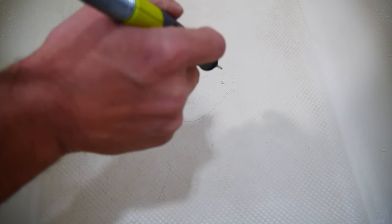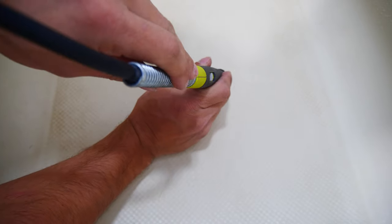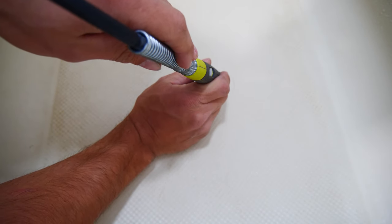Before we begin fixing the area, we want to stop the crack from being able to spread further. We will do this by drilling out both ends of the crack, which removes the strain on the area and mitigates the crack from spreading further as time goes on.